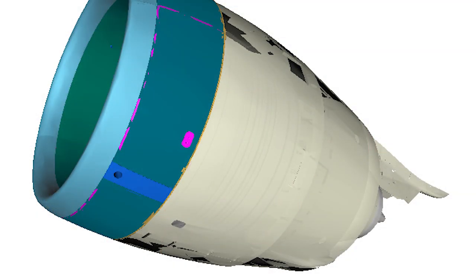On the underside, where all of our thrust reverser and fan cowl latches are and where the access panels are, we want to go ahead and make sure that those get taped off as well. This is going to prevent moisture from getting up into the nacelle — we don't want any nesting animals. And this will keep your engine preserved for 90 days.